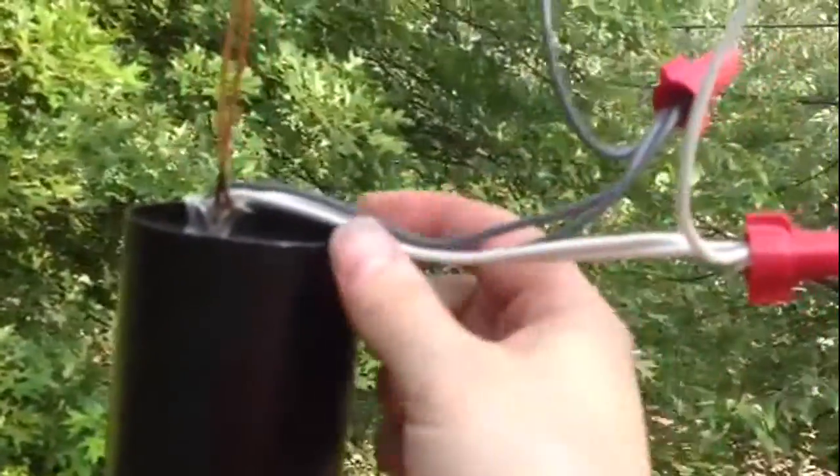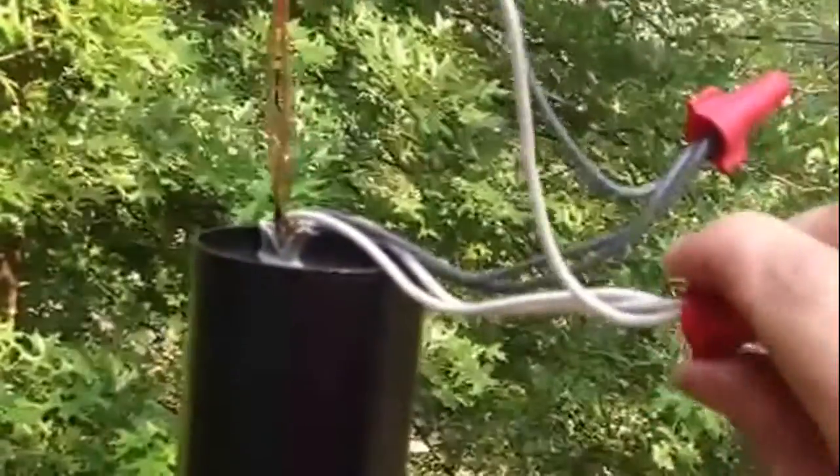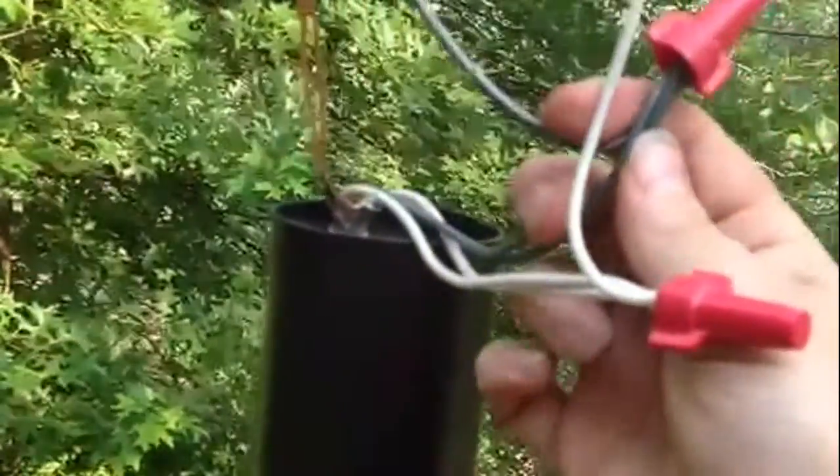What I did, since I connected two wires together — I stripped these wires back and hooked two wires together. I hooked three wires: two from the two I connected together, and one pigtail. So now I've made it into really one connection with one wire nut. When you do it, you should use wire nuts — don't just put wires together. I'll tuck all this inside and then we'll just be connecting these three wires. I'm also going to tape these up just to keep it a little weather tight.